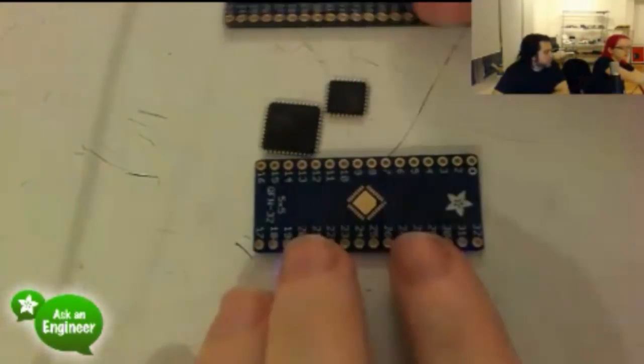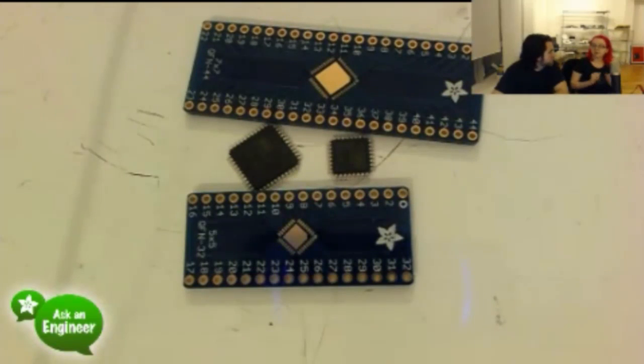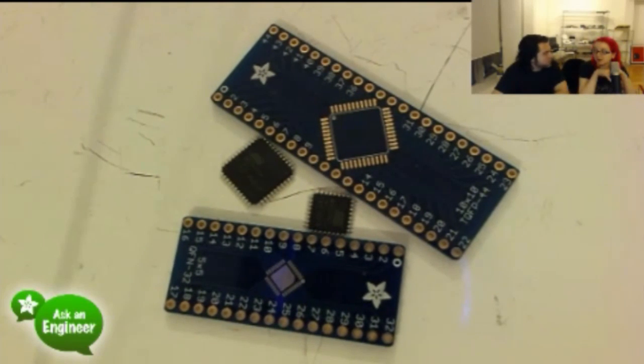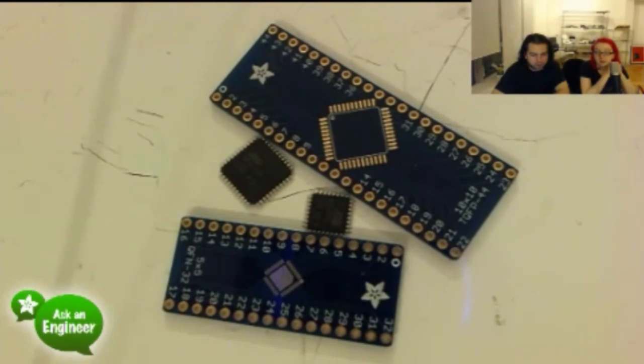We have more coming. Someone had a request to extend the pads — well, you can extend the pads, but after a certain point it becomes easier to bridge them. They are extended somewhat, but we try to make it reasonable so you can solder it with a fine-pitched iron. If the pads are too long, they're more likely to bridge and you also can't fit it on a board. Could you paste and bake these? Yeah, you could do that. You can drag solder them too.